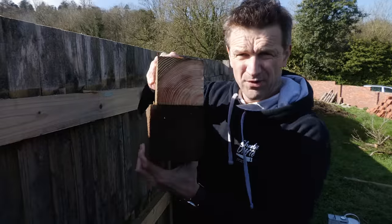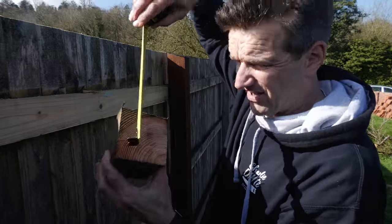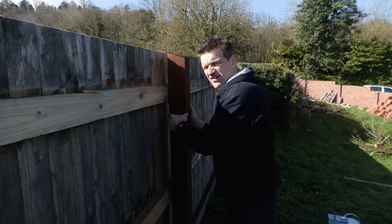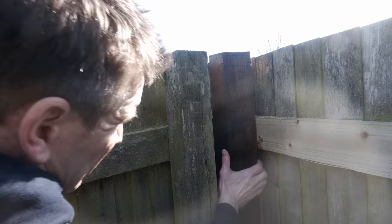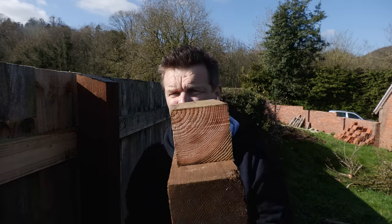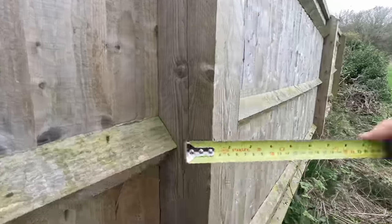That bigger post is four and a half inch or 115mm — when compared with this more typical post, which you're more likely to get from a fencing company at four inch or 100mm, the difference in sturdiness was striking. Obviously the narrower one is absolutely rock solid now it's fixed into the corner. Just something to be aware of if you're planning to build a pergola or other structure — if at all possible go with something slightly wider. That Aris rail fence at the bottom of the garden used v-notched posts at five by four inch or 125 by 100mm.